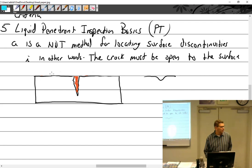You wipe it, and the procedure is dry, then wet, then dry. We wipe it off, and you can't just keep wiping. Like if I'm over there, what are you doing? I'm wiping, man. It keeps coming out of this crack. Okay, it's supposed to come out of the crack. To me, that's part of the inspection procedure. Part of the inspection procedure is while you're wiping, you're actually looking at what's happening. And if you've got a crack indication that keeps bleeding back out at you, that's a crack. Stop. Right? Just because they say the inspection starts later, I don't count that. Inspection starts the minute you walk into the booth and you put your NDT hat on. That's when your real inspection starts. So if it starts seeping back out, it's a crack, I'm done. Okay, so we wipe, dry, wet, dry.